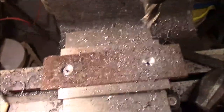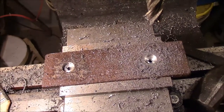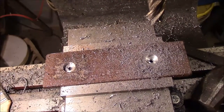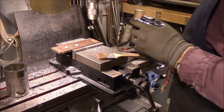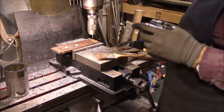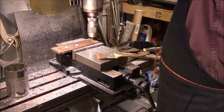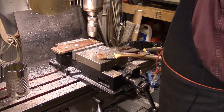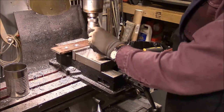I'm going to get you in here where you can see — there's the holes that we cut. Next we'll go back over to the bandsaw and mark where the holes go. I almost forgot — I got one more thing I want to do over here. I want to tap a hole so I can put a bolt in there. You'll see why when I get it back over to the bandsaw. I'm going to put a little oil up there.